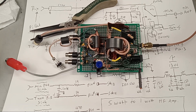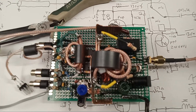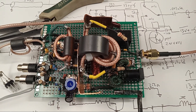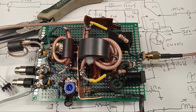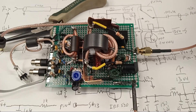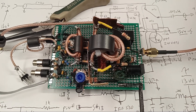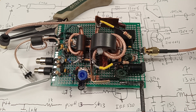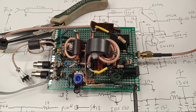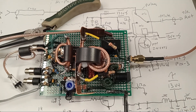Here's my Radio Berry Pi hat with an HF RF amplifier pre-amplifier on top. It puts out five watts on 160, 80, and 60 meters, a little less on 40, and about one watt on 10 meters. It's made on a perf board — it's not pretty, but it works.